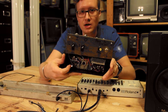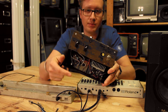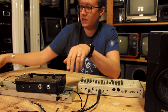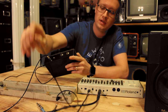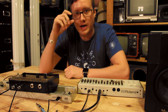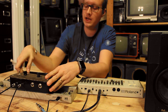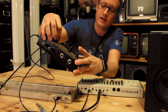This other circuitry over here has got preamplification that comes after the spring. So it goes through the spring, comes back out, and goes back through this preamplification. The basics of how this works: I've got my 12 volt power supply, my send to the spring coming from the power amplifier, and then coming back from the spring going through a couple of op amps in order to be reamplified up to close to line level. I've added a wet mix and a dry mix, which is good for when I'm using it as a series device, or if I'm using it as a send, I can just turn up the wet.